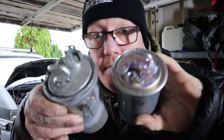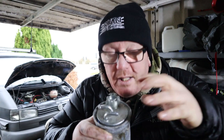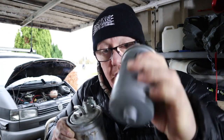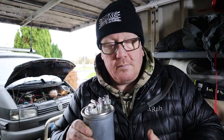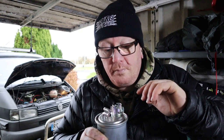There's the old one, there's the new one. That was a bit of a bitch to come out because the pipes that go on there just get stuck. But it's out. If you take this plug off, drain it, put the plug in the new one, fill it full of diesel, put it back in and pray it starts. So we've got the new filter full of diesel, put it in, split pin in, two tubes on, turn the engine over — fingers crossed — it will eliminate and get rid of all the air bubbles and air blockages. Ain't rocket science, is it? Put it in.